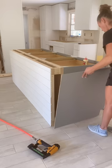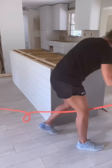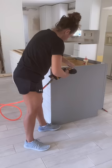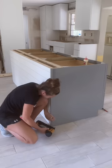I put my cabinet panel on the side and traced out where I needed to make the cuts. To cut the panels I used my jigsaw, but you could also use a circular saw or a table saw. Once I cut the cabinet panel to size, I attached it using wood glue and my brad nailer with 18 gauge brad nails. I suggest using brad nails around the perimeter so you don't have to fill in any holes. To finish off the corner between the cabinet panel and the shiplap, I cut a piece of outside corner molding to size and did the same on the opposite side.